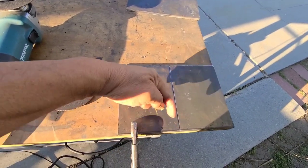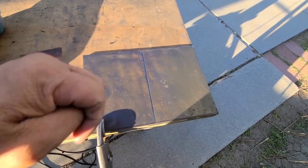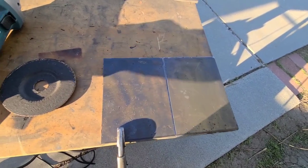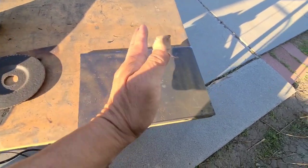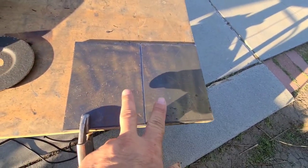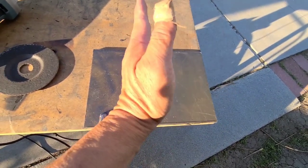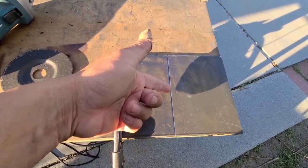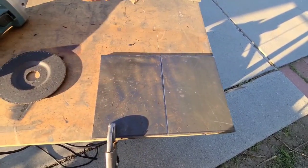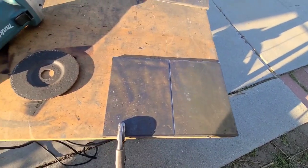I just made my first cut with a thin blade — as you can see it's a very thin blade. I got it down to the depth I need. Next I'm going to use a thicker blade to open this cut up a little bit, because I'm going to need to fold this into a 90 degree angle. This will bump if I fold it, so I'm going to open it up so I can fold it to 90 degrees, and then hit a weld all the way across it.